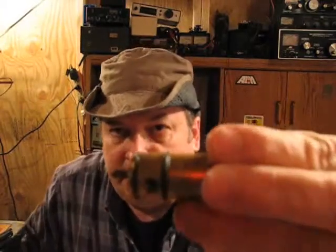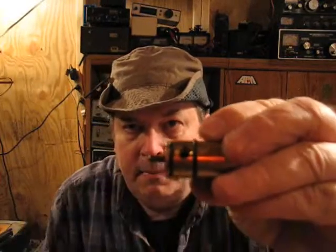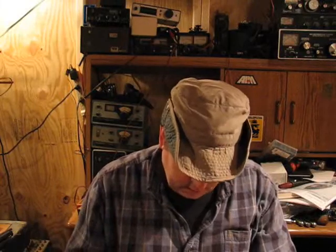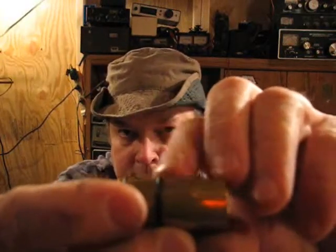You can see it has two O-rings. Normally it only has the one back here, but I've read about a modification where you put it in a lathe and cut an additional groove on this side to put in an additional O-ring. I just did that on my mini lathe.